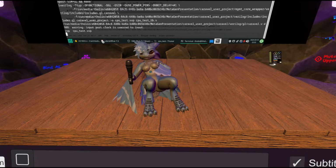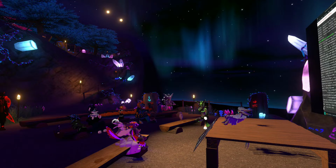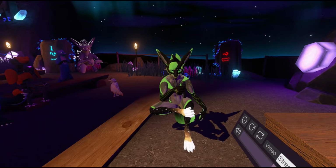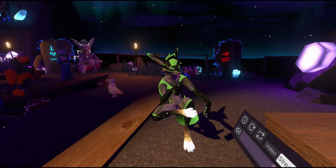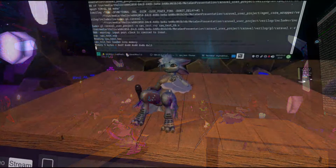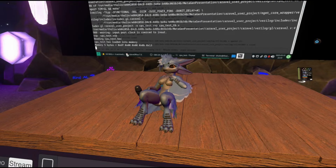Wow, that's very cool. In the previous talk, you showed some examples, like a DNA sequencer and stuff. Did they use this tool for that, to develop something? I assume so. The thing with analog on SkyWater Foundries is that it's not very developed right now. The community or the open source tools aren't that far along. XSchem is definitely the most mature one, so I would hope they use that. But currently, people are working on automated flows for analog also. People are working on different ways to actually design analog circuits. Right now, it's kind of the Wild West in analog, where a lot of stuff still needs to be made and discovered.